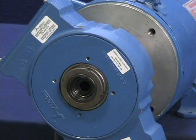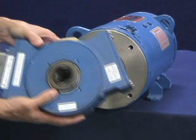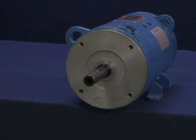Slide the AV-685 off the shaft. Do not pry the AV-685 or pound it off the shaft. If the AV-685 cannot be moved by hand, use a gear puller to remove the AV-685. Inspect for bearing damage, as gear pullers can damage the AV-685 bearing system. This concludes AV-685 removal.